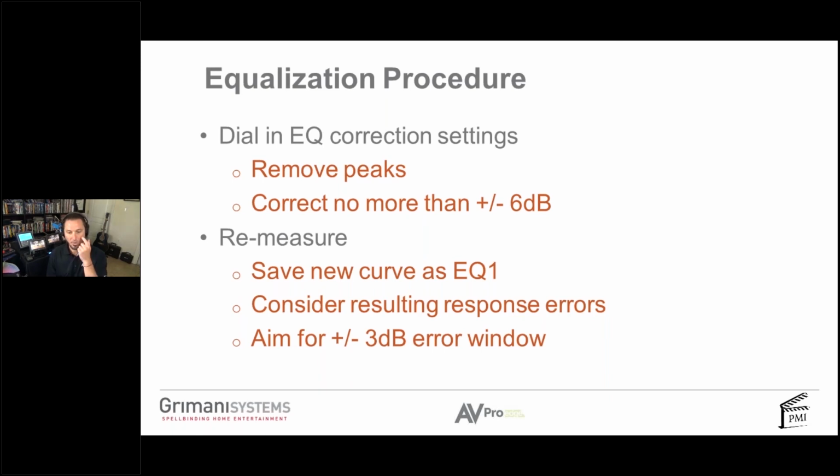That happens. And that happens when the error in the room is what's called non-minimum phase, which is that things are unpredictable in the amplitude and phase and it's not working out. And so you need to be able to see that. Don't just rely on the fact that you're going to draw the inverse curve and it works out. So the better auto EQ systems look at this stuff in the time domain, and they actually look at the relationship between amplitude and time and only give you corrections for the ones that are correctly controllable.